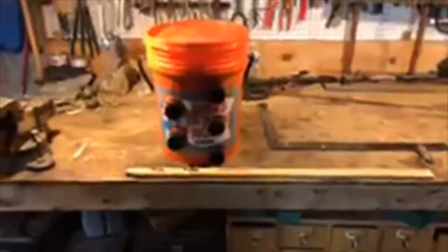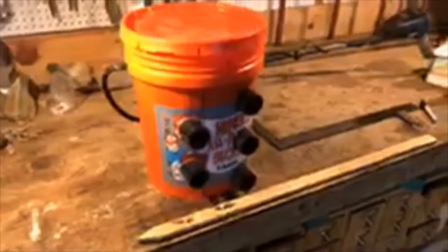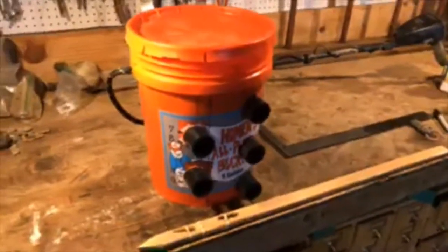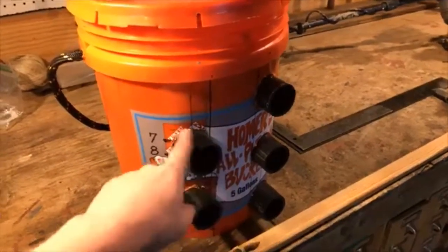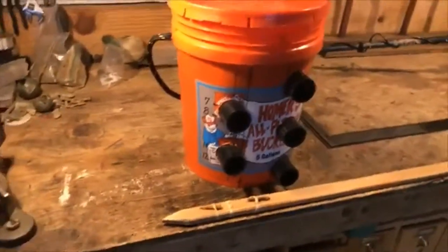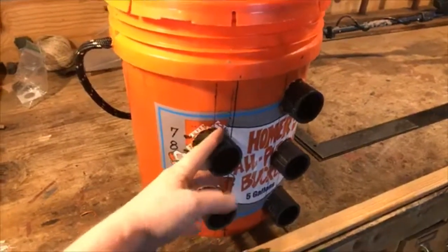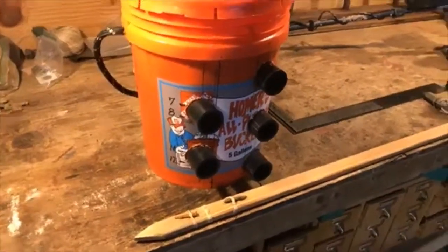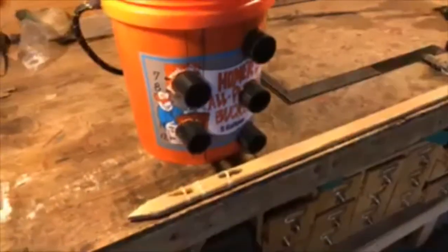As you can see, you can get a bucket from Lowe's or Home Depot. One's going to be orange, one's going to be blue, but they're all the same. You're going to want to purchase the lid with it. And as you can see here, this black pipe that I used is a 2-inch OD, which means a 2-inch outer diameter. I think it comes in maybe 10-foot lengths. For these, the tubes that you're going to make, that go through, are going to be 12.5 inches long. So as long as you get 6, 8, 10 feet, I forget what it came in. I think mine was about 10 foot. So you're going to need a bucket, the lid, about 10 foot of this pipe. You'll have a little bit left over maybe for another one if you want to make it.